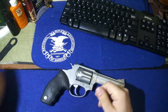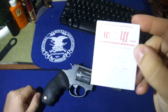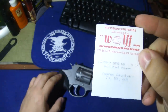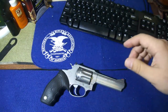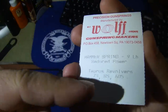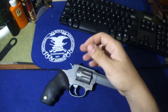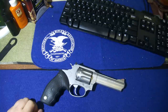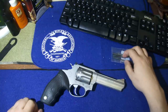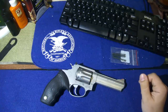So what we're going to do is swap out the spring. You could go with a company like Wolf and look for like a 9-pound spring — that's what we call the hammer spring. I did try that, but I had a couple of failure-to-fires. A lot of people swear online about getting an 11-pound spring. For a small frame revolver Wolf didn't have the 11-pound, but I noticed that the size spring would be for a Taurus revolver of the Model 73, 85, or 605. So I gave a ring to Taurus, told them I was refinishing a Model 85, and asked for an 11-pound spring. I ordered three at a buck a piece plus shipping — another three or four bucks — three just in case I had to clip down the coils to fit.